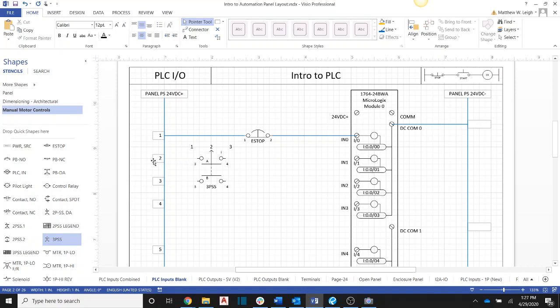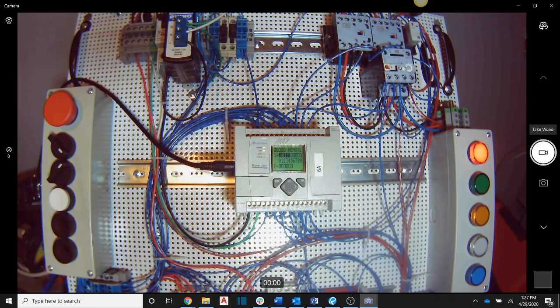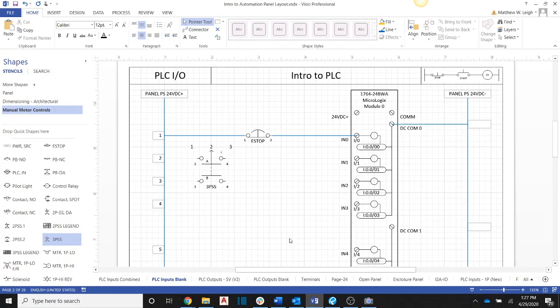for drawing purposes, I'm just going to pull this from the rail over because it's going to look nice and neat. When we actually wire this, it's off screen here. I brought one wire down to pin 1 of my e-stop, and then I have jumpers going to all the other inputs down there. I didn't pull 6 or 7 different wires up here to the top for my power supply. But for the convenience of making it look clean here, I'm just going to go ahead and draw my wires coming from the rail. And you could do it either way if you wanted, okay?